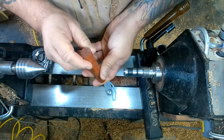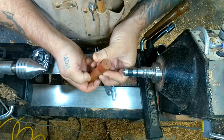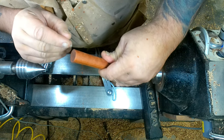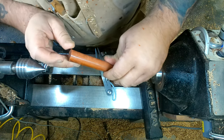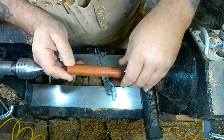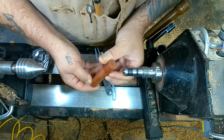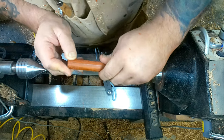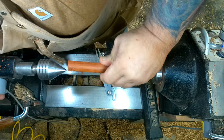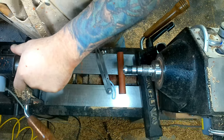So we'll go from one to two. My stop line's right here. One, one, one, two, two — could be right there. Let me make sure I'm in the right place. I'm going to press it in a little. I have a sharper live center — I'm going to switch out from the 60-degree to the finer live center because we are working in such a small area.